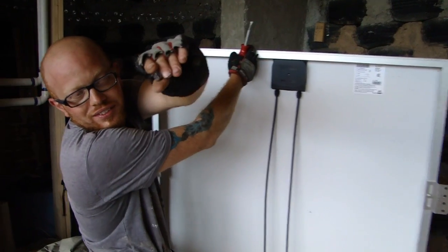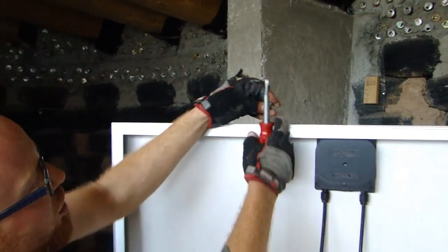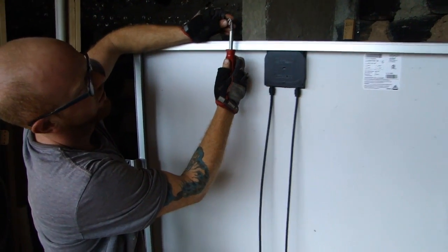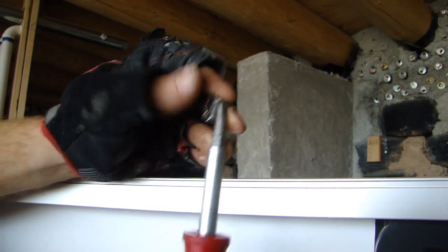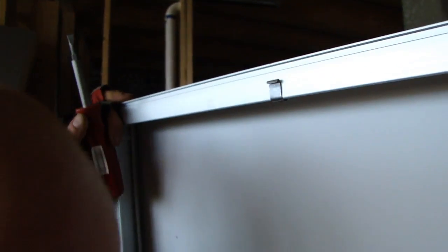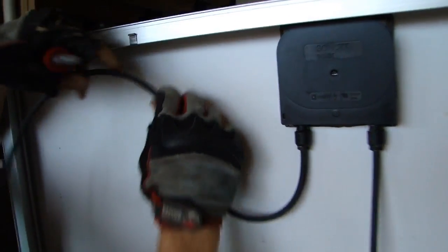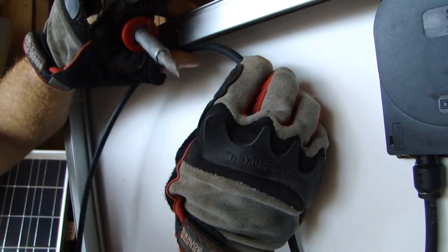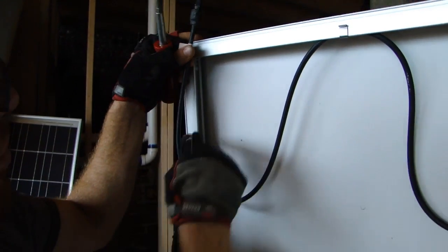These are called Acme Clips, and they're pretty amazing. Someone's making a lot of money off of these — they're way too expensive for a little dinky piece of metal. You insert a flathead screwdriver into this little notch back here, and that gives you leverage to pry this back. They have little teeth that grip the edge of the module, and then this springy loop will grip the wires. We're going to put one right here, like that, and then I'm going to swing this up into here. You want to leave enough of a bend in this lead — you don't want it to be stressing the wire. You want to put a little bit of a loop in there. And you want to try and twist the wire so that it's not popping away from the panel.